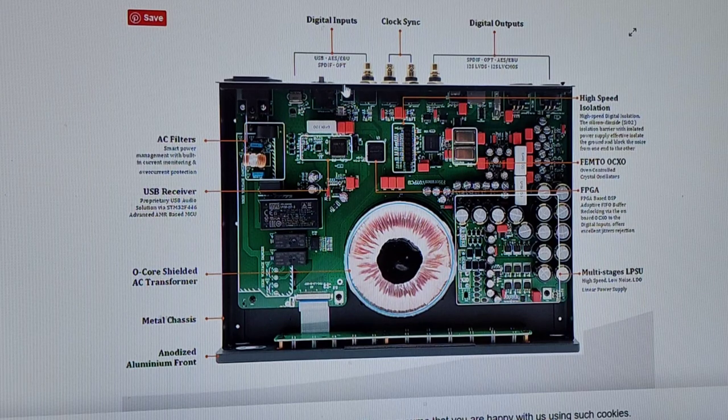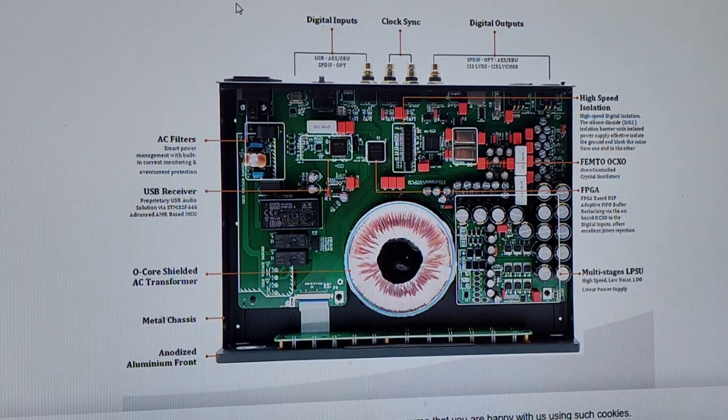And they do have it, but they have Toslink, okay? So their Toslink is a TV protocol. It's a cheap consumer-level connection. It's wobbly. Most of them are plastic shitty cables, and it limits your bandwidth. So if you come out of here optical to your DAC, you're limiting your bandwidth to 24/192. You can't do anything more than DSD times 64, like 2 times DSD, or what is it, 1 times DSD. You can't go any higher than that. So you'll be coming into it via USB, which is high bandwidth, and you'll be restricting the bandwidth if you go optical out.